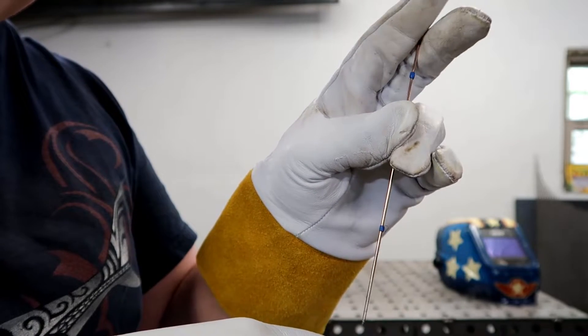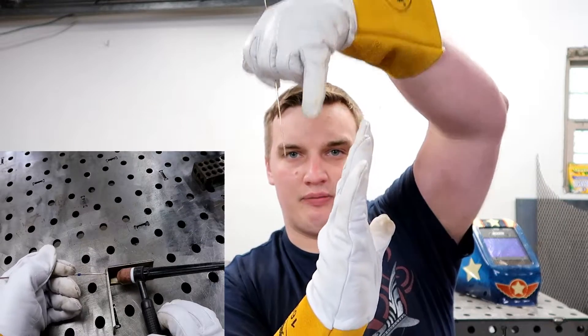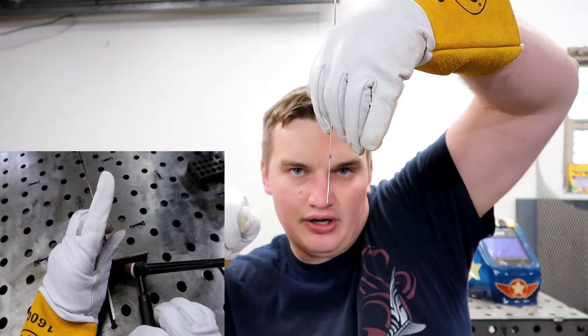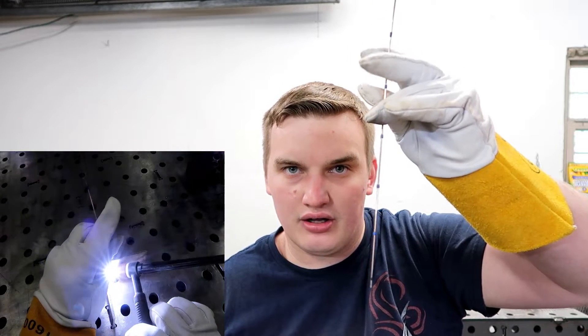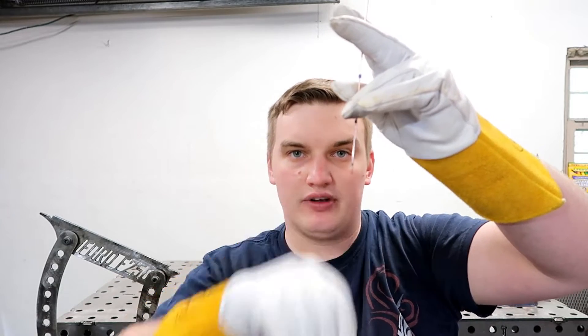This method is mostly used when you're coming in from the top side of a weld — you can just sit there and grip, slide. The main area I found this method to be super helpful is interior corners on parts. A lot of times if you are right-handed you're going to be feeding from your left side, and if you have an interior corner you need to get from the top side down into that corner. You can either articulate your hand over and try to get down into the top side with your torch over, or you can rest your wrist on the top of that part, angle down in, and feed that rod in. Since you're coming in from the top side, you don't have to worry about lack of accessibility from your left side.